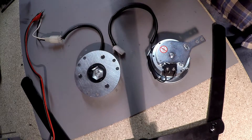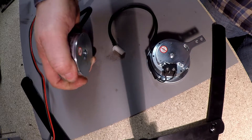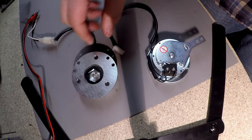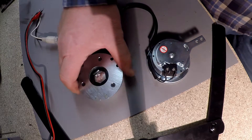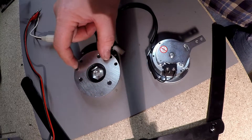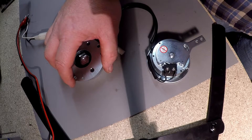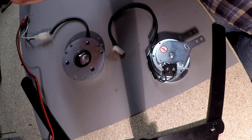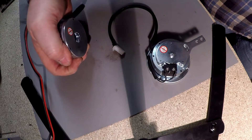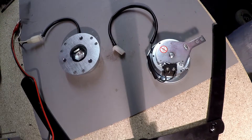So it's always important to feel the brake if you have a problem. If the brake is roasting hot after that particular time and the motor is getting hot as well, there could be a problem with the brake. What I would do is remove the brake off the motor completely — take the three screws out, or some may have four screws — take it off, leave it hanging next to the scooter, and drive the scooter again for half an hour. Then feel the electric brake; if it's roasting, that's okay, then feel the motor so you know where the heat is coming from.